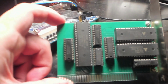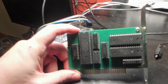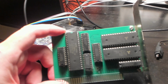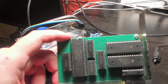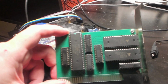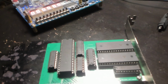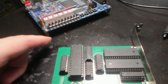So this is focus. Doesn't like to focus for some reason. Well, anyway, I have a V20 there. I have tried to run this demo actually with the 8088 from Intel as well, but I think the reason the two final sections of the demo don't run properly, the org scene and the lake scene, is that I'm using SRAM, static RAM, these two chips here, and that probably you have some wait states with your DRAM and DMA controller, which this system doesn't.